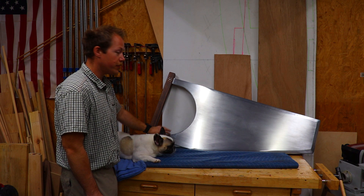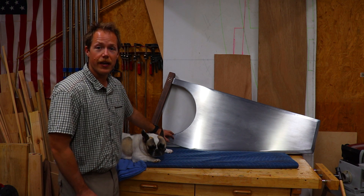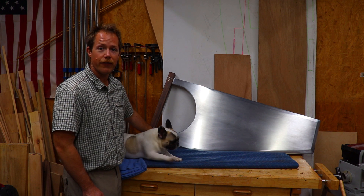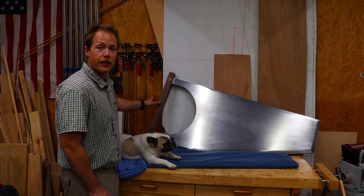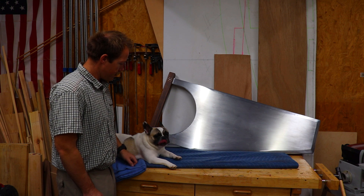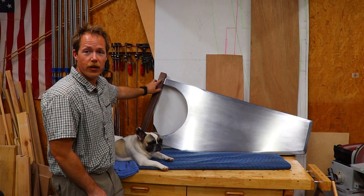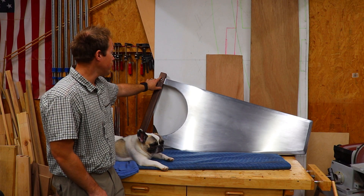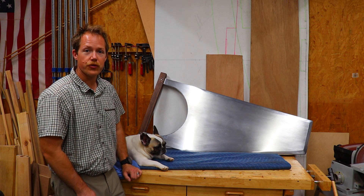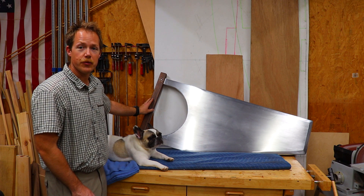As you just saw in the montage, I finished the dagger board by wet sanding it up to a 2000-grit finish, then used a buffing compound and a buffer to polish the dagger board. It's not a mirror finish, but it looks really nice and I might keep working on it off camera to see if I can get it a little shinier. Next, I laminated three pieces of black walnut and pinned the handle to the dagger board using aluminum and brass rod — one piece of aluminum rod was probably sufficient but the brass rod made a nice accent. Once the epoxy was set, I flush-trimmed the rod and finished the handle, though I still need to add a waterproof protective finish over the top.